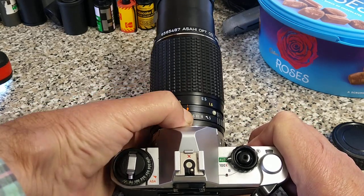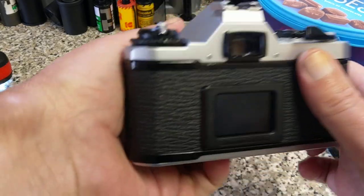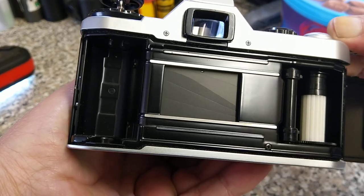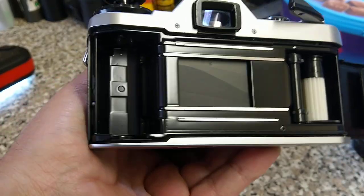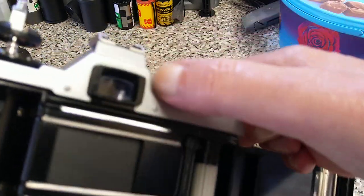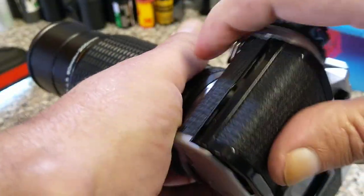It doesn't meter during the exposure like the OM does — I quite like that feature as it can change settings on the fly if lighting changes. Let's have a look inside now. We can see the shutter — looks like it's a vertical travelling shutter. Take-up spool, film advance, film goes in this side and advances across. The seals don't look too bad. It's worth testing this camera with black tape after taking a couple of shots just to make sure it stays light-tight. Pressure plate looks in pretty good condition. Shutter's working, no oil in there — quite a nice camera.